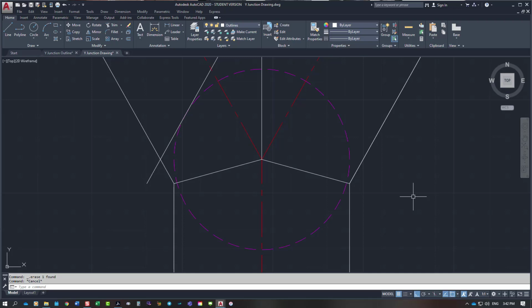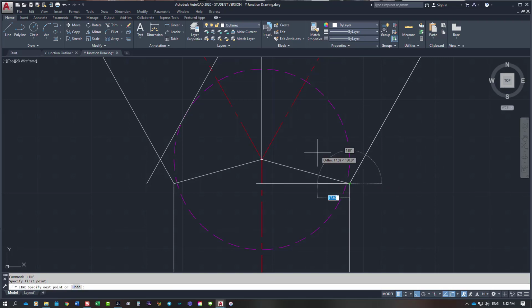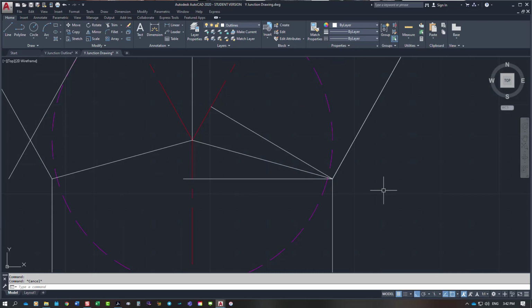So what I'm going to show you now is that this cylinder coming in, and this cylinder coming in at 30 degrees here, and the one coming up from the bottom vertically, we're creating a joint line which is a split perpendicular. Where is it? There it is there. So this joint line here is actually a split between the two. So it's an elliptical joint, but it's half of the cylinder coming in from the top, and it's half of the cylinder coming in from the bottom.